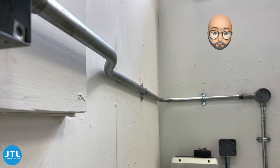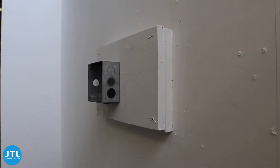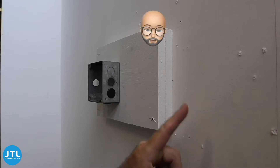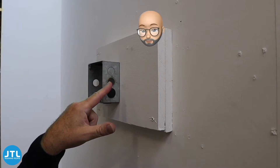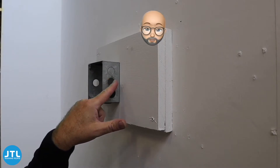When pulling multiple bends into a length, you need to start from one end and work towards the other. I'm going to start with the double set, so I need to know its dimensions. The set needs to extend from this wall to the bottom of this 20mm hole, so let's measure the depth.